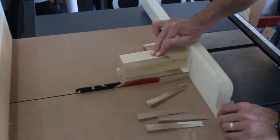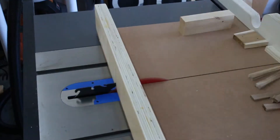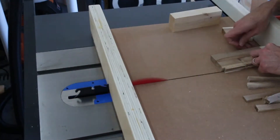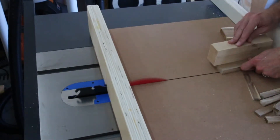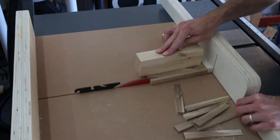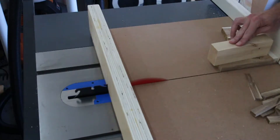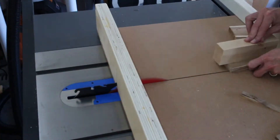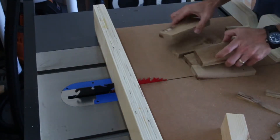I lost the footage, but I made that little wedge with my Wixi magnetic blade angle indicator — that's the only thing I have that could even get near half a degree of accuracy. But as you can see, this is anything but precision work, and when you're doing rustic, precision really isn't needed. Watch what happens here in real time — you can see the cutoff piece getting grabbed by the blade and thrown straight back into the slat on my crosscut sled. This happened several times, and all I had to do to fix it was cut it on the other side of the blade, so the piece shooting back would have the broad side of that wedge going toward the fence and not the pointy side.